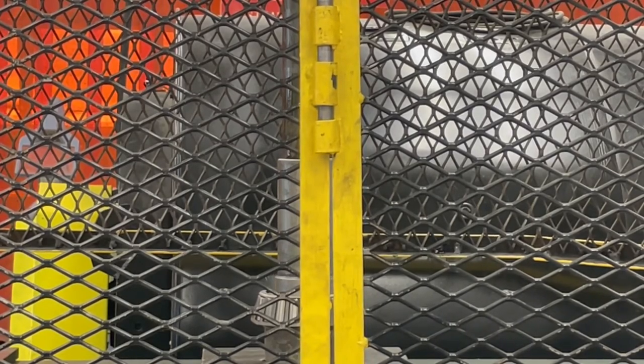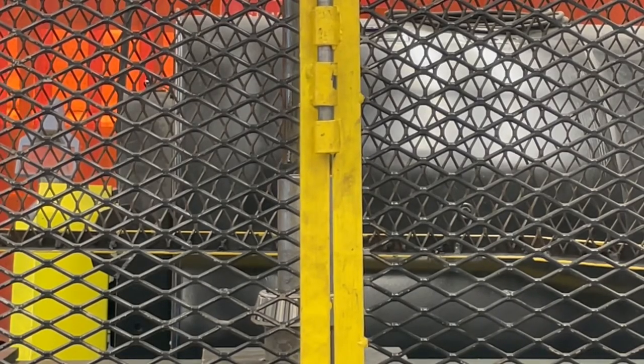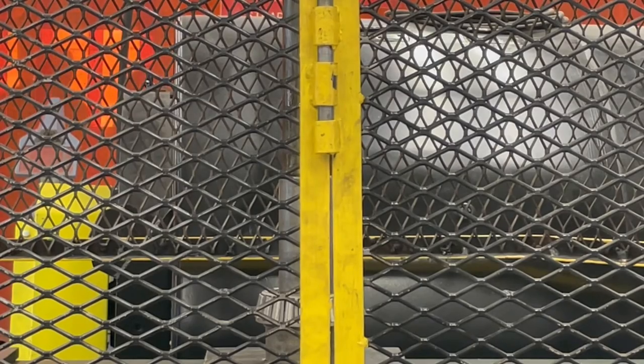So even though this press is good for about 60 tons, I was probably only using 2 or 3 tons of force when I was removing this bearing. And you can see it just made a big pop there and jumped down, and now I'm gonna catch up and I'm just gonna press it out the rest of the way. You'll see that it actually will just drop through at some point into that rubber mat that I talked about and pointed out before.